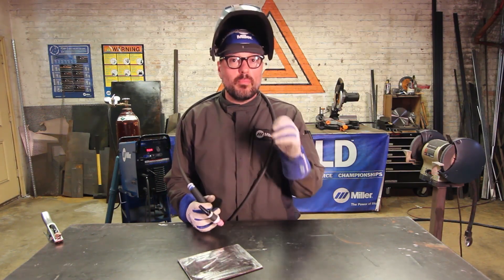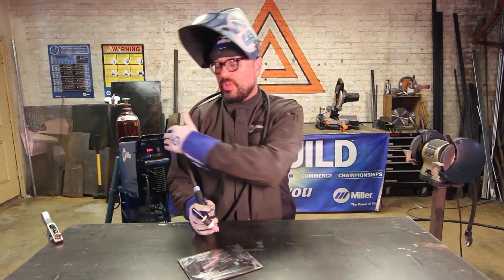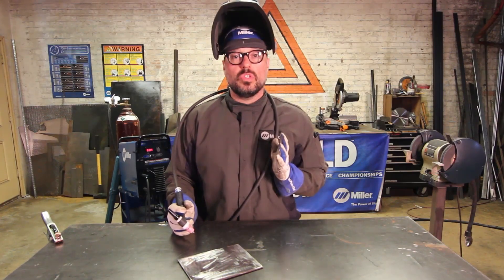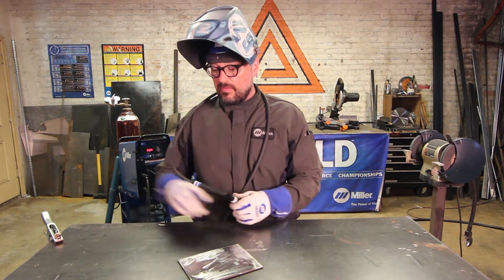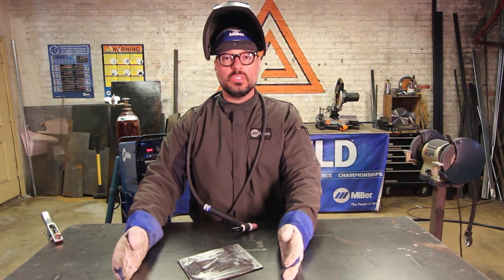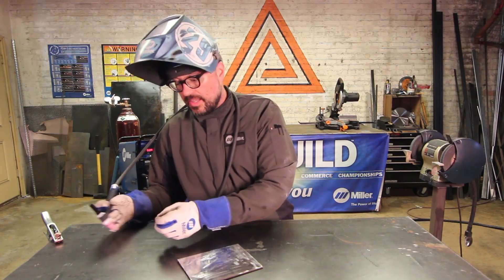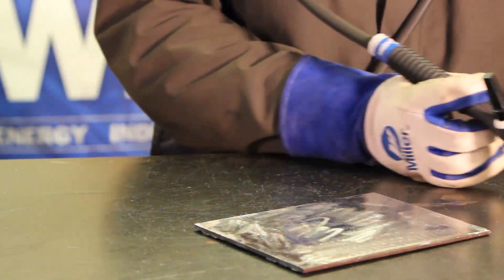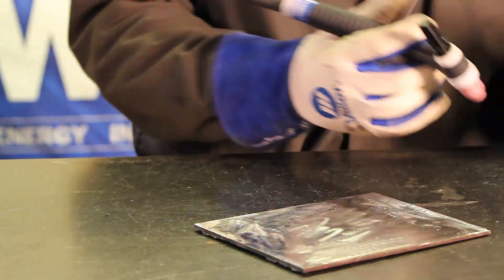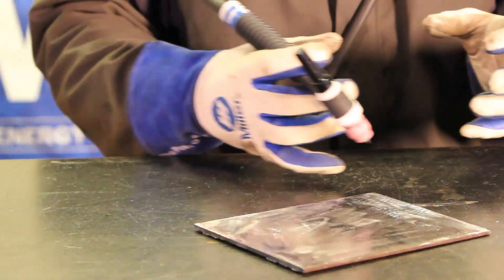That's going to make it more comfortable all the way through, giving you a more even travel speed. Think of it this way: there's a plane on the side of your shoulder and a plane three quarters of the way through your chest — that's the area you want to weld in. If you go too far over, you lean and get out of position; too far past the chest plane and you compromise your rules. Set up the material mostly for comfort so you can move all the way through the weld comfortably.